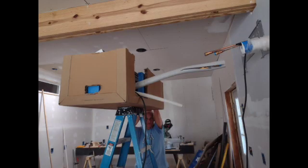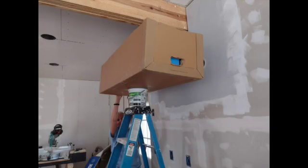As you can see from the photos, it's kind of comical to do that because, again, in most of the installation videos, you're just taking that little piece of beginning of the condensate and the black core. You know, it's just a little stuff and just popping it a few inches through the hole. But when you're dealing with these copper lines that you're not supposed to just willy-nilly bend, you're holding it up, and you have to do all this before you hook the head onto the wall. So it's a little bit of a comedy of errors.